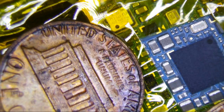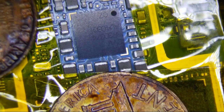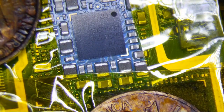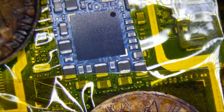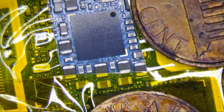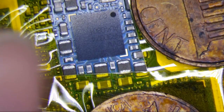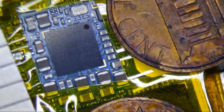Just a note on orientation. I'm going to direct the heat towards the side there because there's a plastic connector there, so I'm going to go that way a little bit. It's 375 degrees Celsius. I don't know what's what here, so I'm just being a little extra careful.